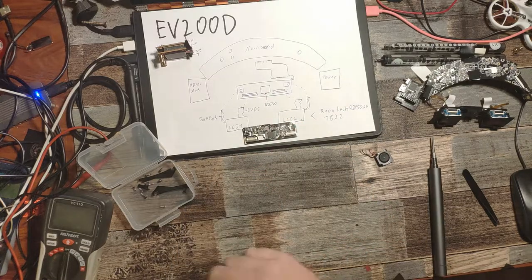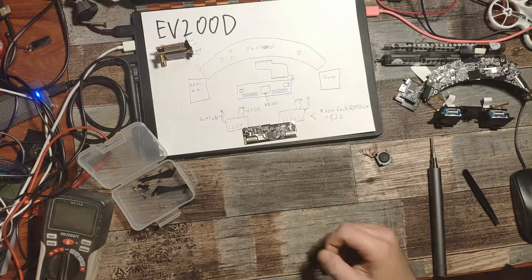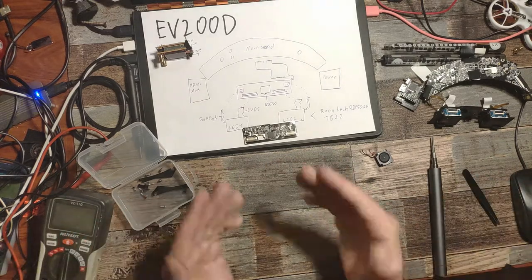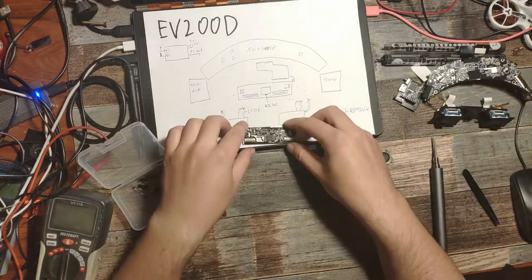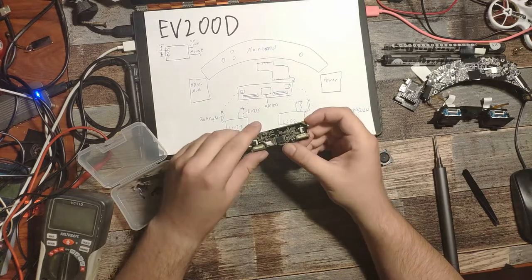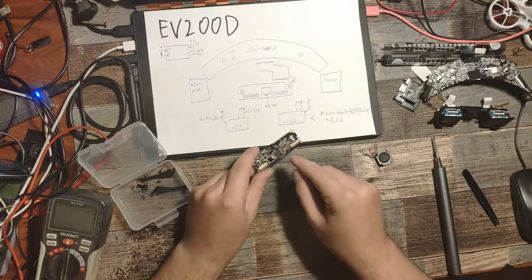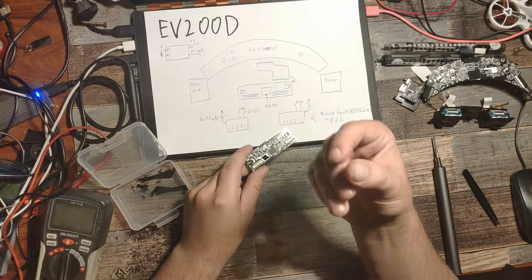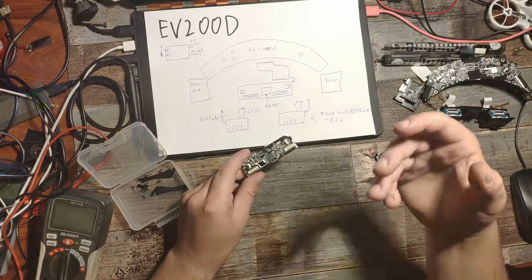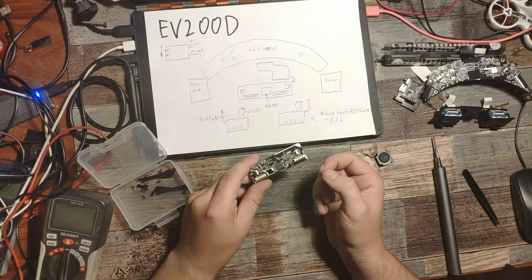My guess was: maybe I check under a microscope if all the soldering is done correctly — maybe it's just a bad solder joint somewhere. I checked under 200x magnification and all the soldering looked good, at least the parts I could see. The only part I can't see is under the BGA. For those who don't know, a BGA is a chip with pads under it rather than on the sides, connected to the PCB via little solder balls. With temperature stress, the board can stretch and some solder balls can become loose — that's my guess for what happened here.